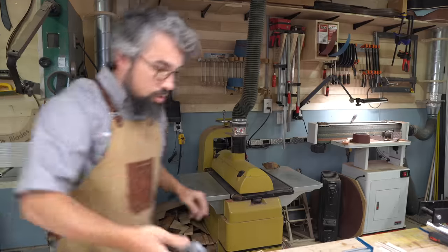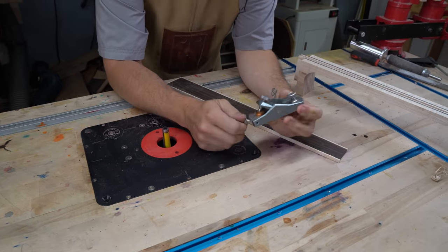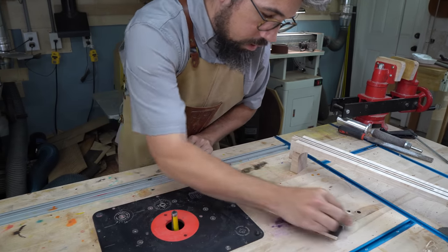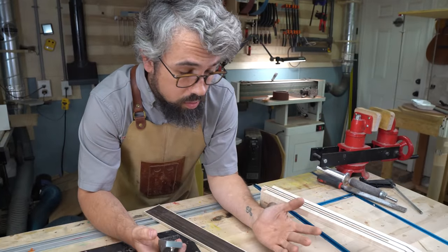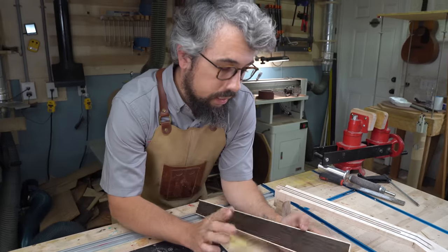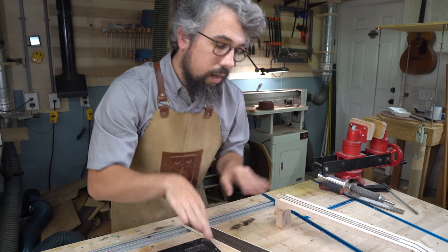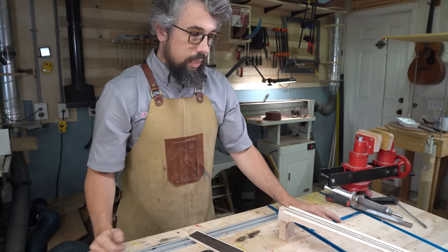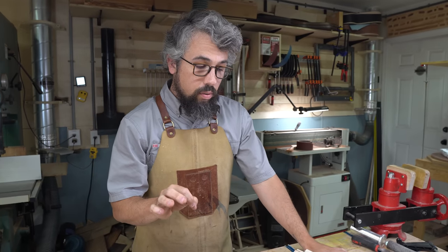If you don't get it perfectly flat, you're going to end up with a visible seam there and nobody wants that. So what I would recommend is use some small hand planes. Work really well to come across here and carefully take this down. By using a hand plane, you can take this down until it gets nice and smooth. We're using figured maple for our binding, so it can be really easy to accidentally chip this out, which is the reason why I like using the drum sander in this particular case. You could also use sandpaper stuck perfectly flat down and run this across it. What I would not recommend is using a DA electric sander — a lot of people's gut is to just come in and sand this down, but if you do that, you're going to slowly and gently roll the edges and you're going to have a gap between the fretboard and the neck. So I'm going to run this through the drum sander, being very careful not to make it any thinner. We just want to get the binding flush.